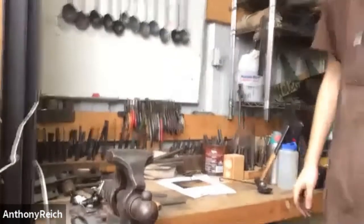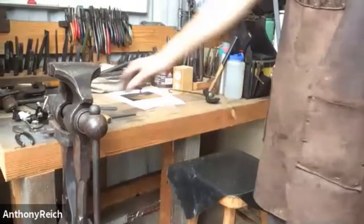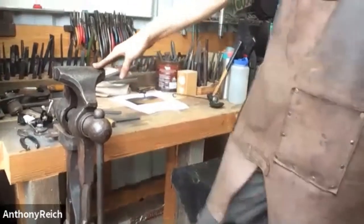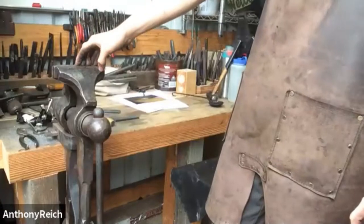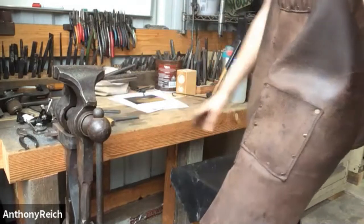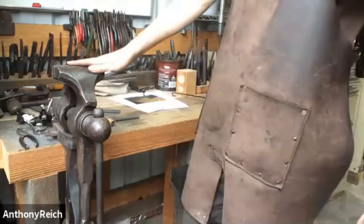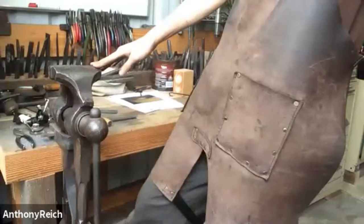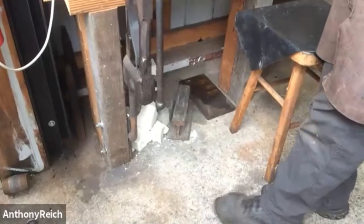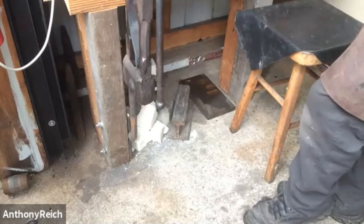And you've got a vise attached to that stump as well, right? Yeah, we just have a machinist vise on the side of that. And this is Ike's. This whole bench is a low bench. The vise jaws are 3 or 4 inches above the anvil height. Ike actually did an article for the Hot Iron News about his vises, and he talks about this, so you can refer to that. It's a lower bench, which allows you to beat on top of things a lot easier than with the high vises. What he did is he bent the bottom leg instead of cutting it off and crippling the vise. Then it's a lower vise without having to cut it off or bury it. Clever.